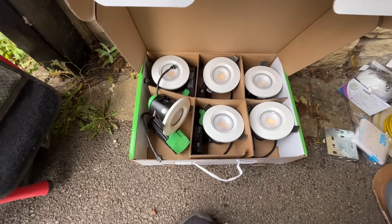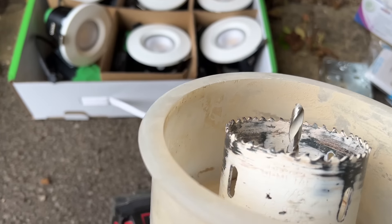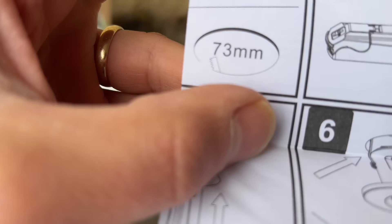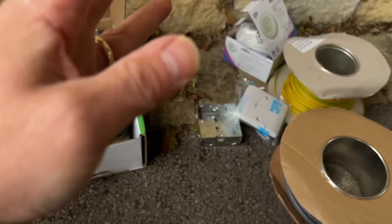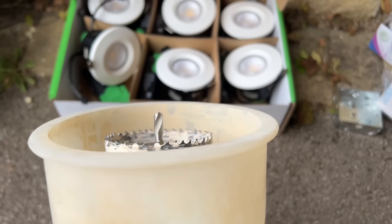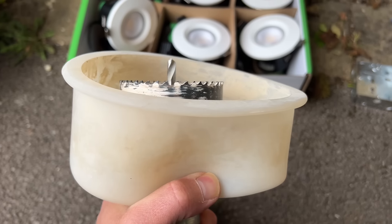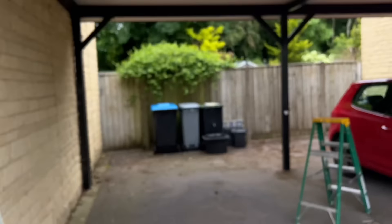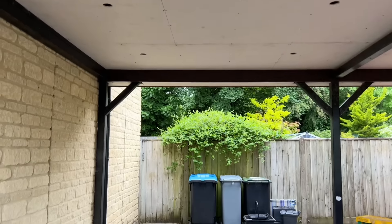So we've got our DA'd holes marked, and then we've got our 73mm cutter, which you can see on the installation instructions. We're going to drill these out — six holes — and then get it wired. Screwfix and 4Light actually sponsored the electricians in the charity football match. And in the time it took James to get me a coffee, I've drilled all six lights out. We're going to run some 1mm cable now, PIR detector in the middle, and then drill a hole from the upstairs bedroom to get our feed down.